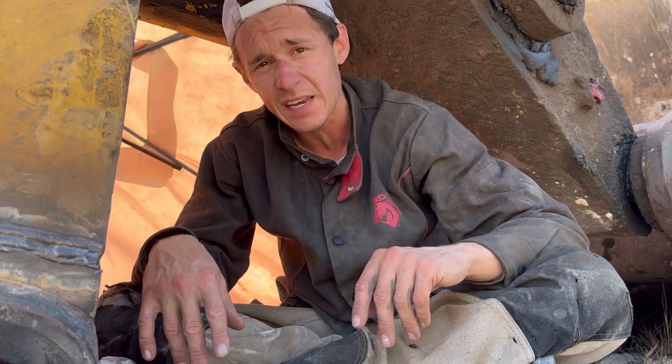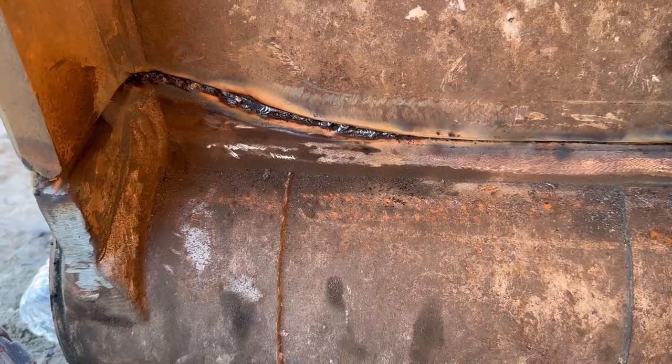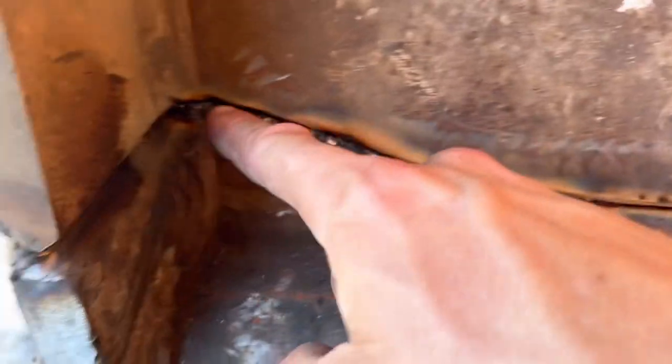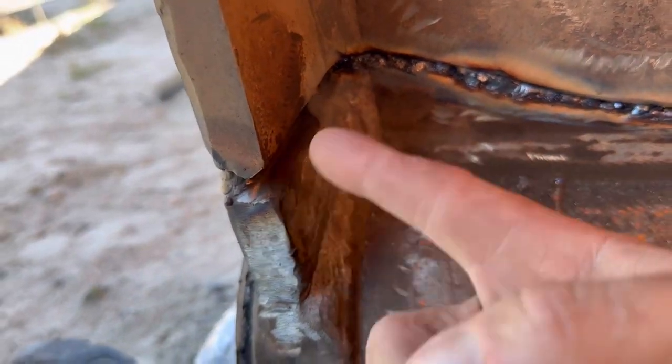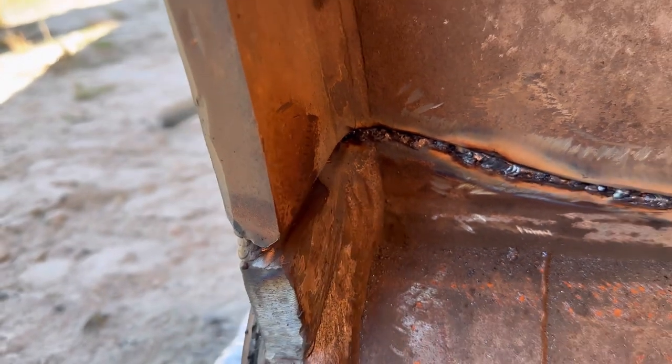This thing has cracked to hell. I mean, I'm putting lipstick on a pig on this one — I know I say that sometimes, but I really mean it this time. So as you can see, there's my root peeking through, and it's not consistent because the bevel wasn't consistent. So I've got to get the die grinder up in this corner and that corner, and then we should be able to do the rest with the grinder. I prepped it out pretty good yesterday — did some of the prep yesterday that you guys didn't see. We're going to finish it now.